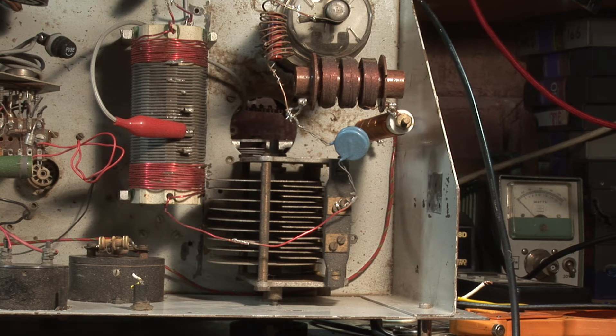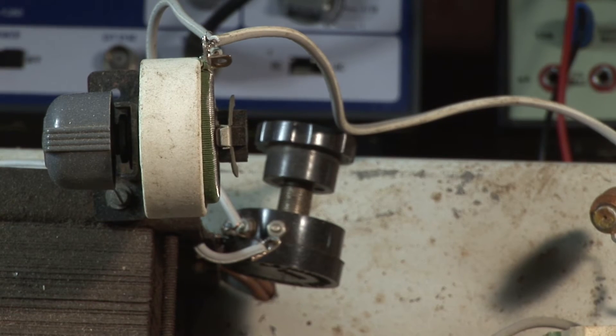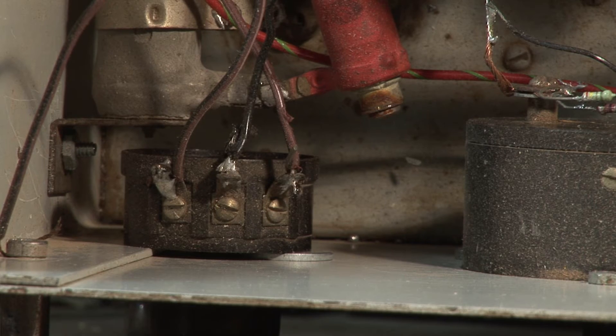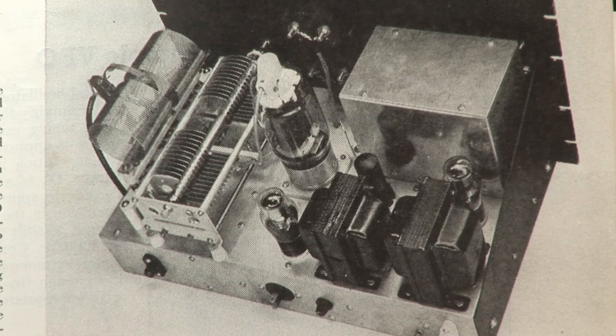It'll load into basically anything from about 10 ohms to 200, so you don't need to worry about SWR and all those things — just tune it up until it works. I like to have a grid bias voltage in case something goes wrong with the drive and you don't pop your valves. As well as the protection circuits, I put slow-blow fuses everywhere in case something goes really wrong. I adjust the grid voltage and screen voltage to the highest possible output at the lowest possible HT, so I get about 100 watts out at 900 volts. Of course, my stuff never looks the same as it does in the book — I'm more worried about what it sounds like.